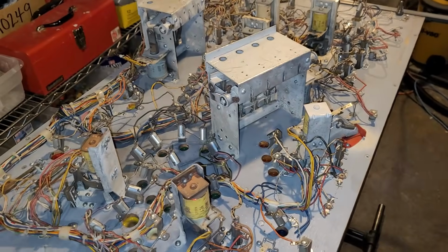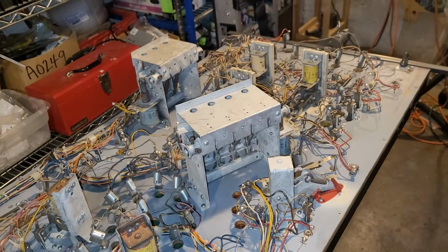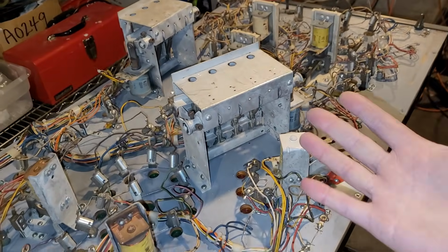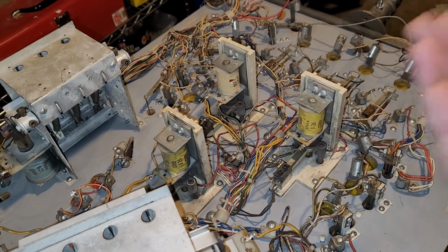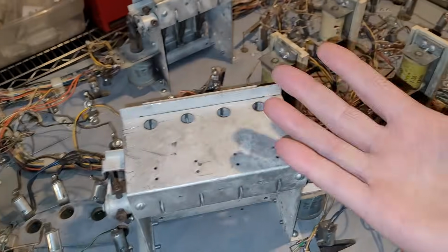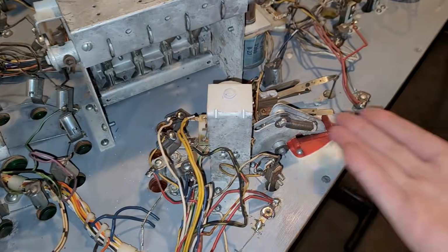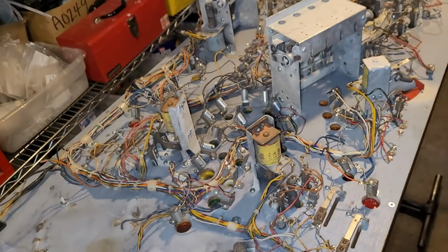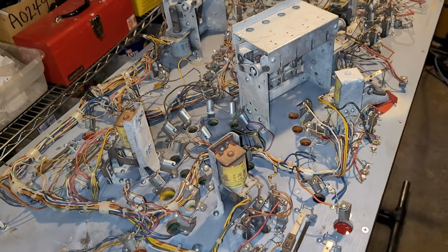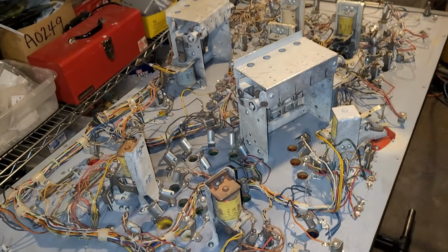friggin' 70% of the work that's involved in swapping the parts over to a new playfield. Like, I'm going to take apart all the pop bumper mechs, clean them, replace the parts, put them back in. I'm going to do that for the drop target banks. I'm going to do that for the slingshots. Why not do it for this up kicker? I already did the out hole. So by the time I've done all that stuff, I'm like 50% of the way. Also, I'm removing every post, replacing them, lane guides, replacing them.